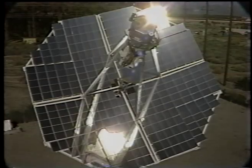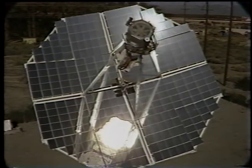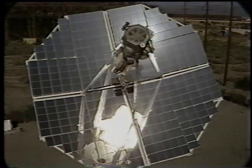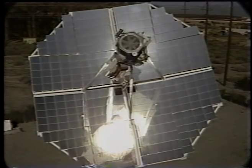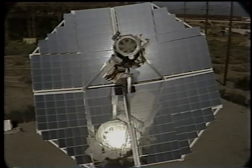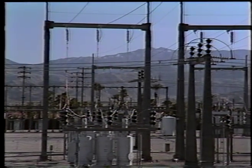When the module is on sun, solar radiation strikes the mirror facets and is focused into the receiver. The receiver is coupled to the Stirling engine, which converts the heat energy to mechanical energy, driving the generator and creating electricity. The electricity is sent through the control systems to the substation for use by homes and businesses.